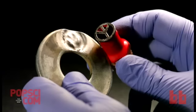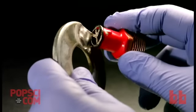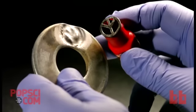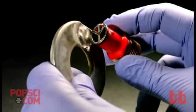The reason the shape came out so blurry is because I was not able to control the distance very carefully and the insulation around the outside of my bit was not very good, so current tended to flow out to the sides instead of only straight up and down the way it was supposed to.